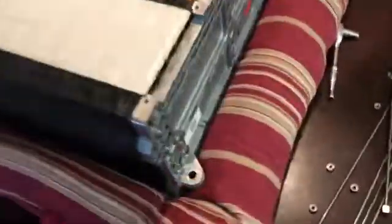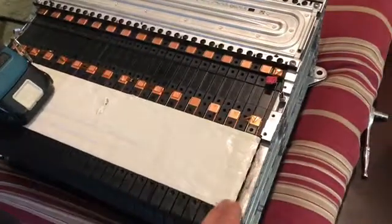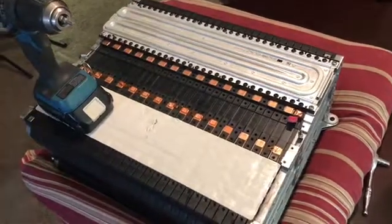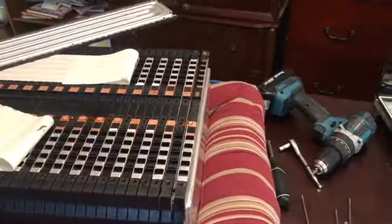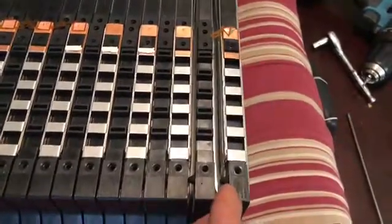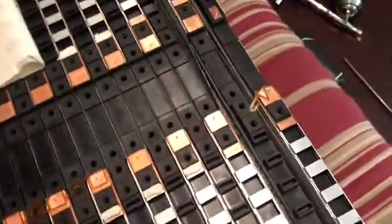These rods go all the way through it and hold it together, and this chip holds all those cells together as well. I tested the voltage on this entire pack and it's sitting at 0.71 volts — so for all intents and purposes it is completely dead. I took the back off of this module, and if you look really close, each one of these prismatic cells is welded — welded there, welded there, and welded here — it goes back and forth.